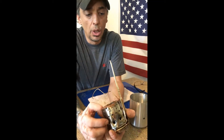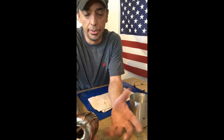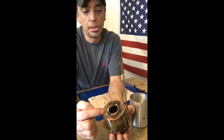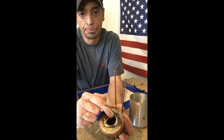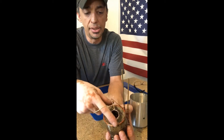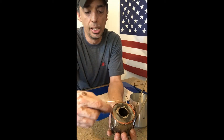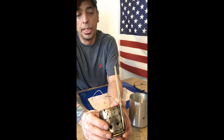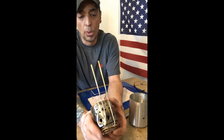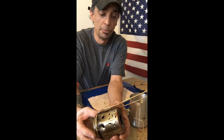You can get away with a few runs — you're not going to be powering a real airplane with it, and as it's a model you're not going to fall out of the sky. You could probably get away with running it a few times and having some fun, but I would suggest silver soldering like I did on the inside here. You can buy yourself a roll for 20 bucks. Make sure you've got plenty of flux on there and braze it in between the walls. This is stainless steel so you have to get a little hot, but it works well. This basket actually works really well now.